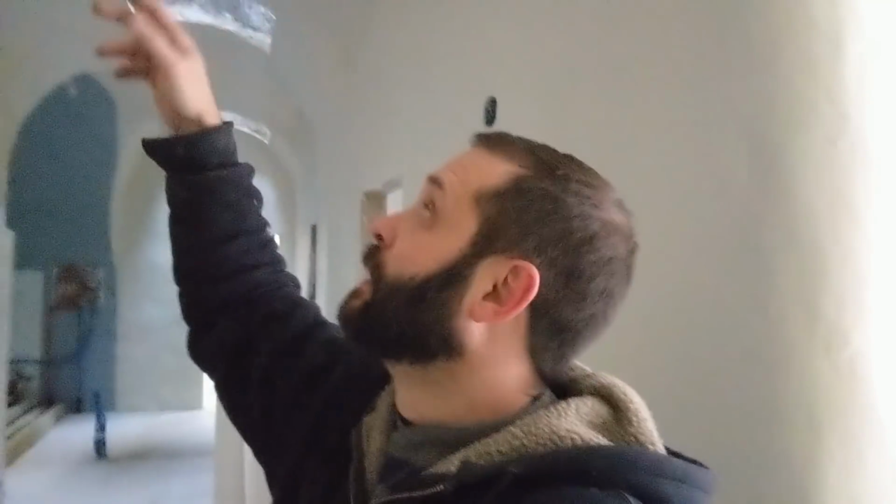So, okay, here is the hallway. Right now the hallway looks about 6 feet wide, but in reality it'll be 4 feet wide in the end. So on this side, the 2 feet along here will be closet space that runs along this wall, and then I'll have a false ceiling with the 2 foot radius, top made of wood slats, like tongue and groove wood boards, and then of course connecting into the skylights that are coming down. Right now there's no lights on in here, this is just lit by all the skylights.